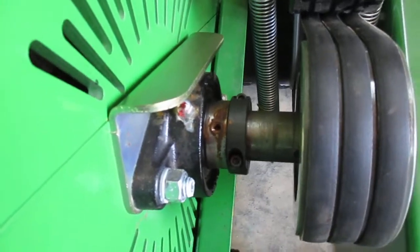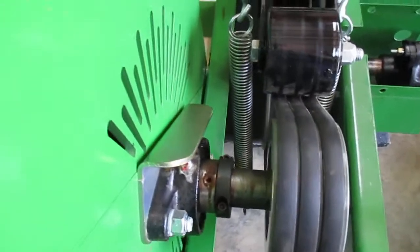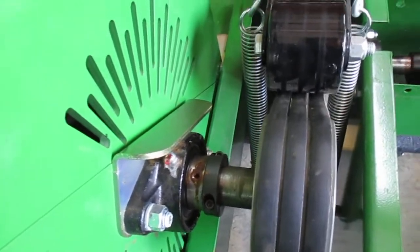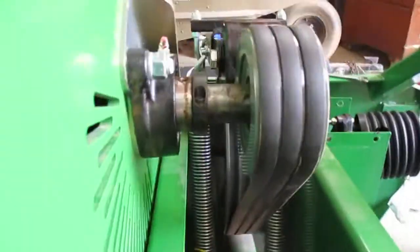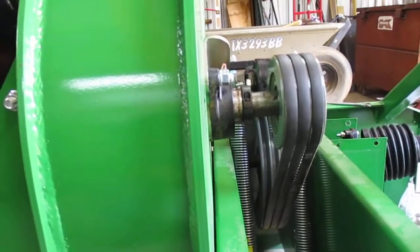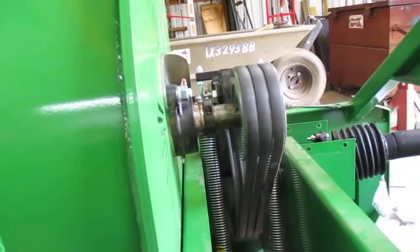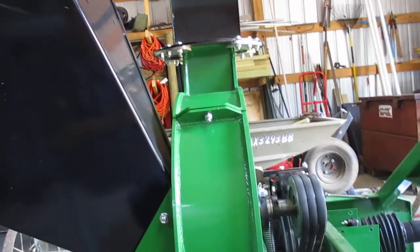You've got your bearing collar and a retainer that goes on your shaft — all those were assembled dry. I went back and anti-seized all the set screws and torqued them down to 30 or 40 foot-pounds. Same thing on the shaft collars — they were actually rusty, just like the shafts were. I went back and anti-seized all that and all the fasteners. The internal shafts within the housing were covered in rust, so I sprayed them down with PB Blaster.